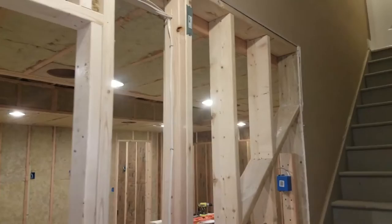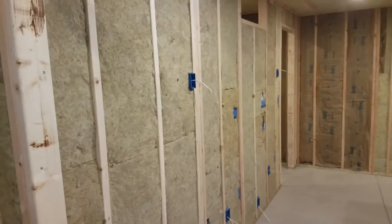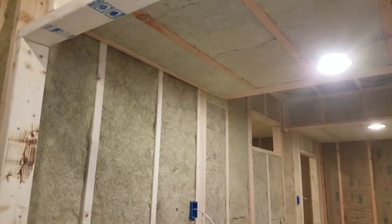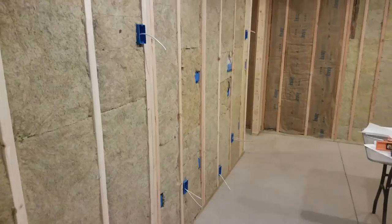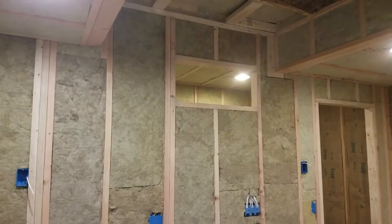This area I'm still going to work on. I've got some drywall and framing things to work out, so I'm just going to leave this undone for a little while. In the rest of this area I've pretty much packed insulation everywhere there's a stud. That's probably not necessary — I'm sure it's overkill — but I just wanted to make sure there weren't any hollow areas. I don't know what kind of resonating there might be when you're looking at having subwoofers running.